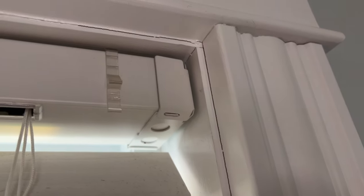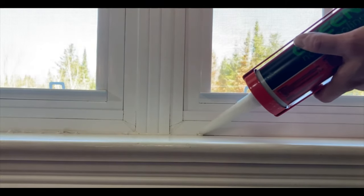The first thing to do is to get rid of all the gaps and cracks around the window. Houses will move and shift, and that will create cracks around the window frame. Those cracks, which might seem quite minor, can let a lot of noise back into the room. So you have to seal them up, and how you do that is with acoustical caulking, or acoustical sealing.